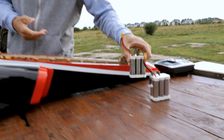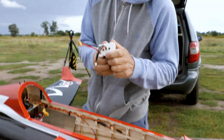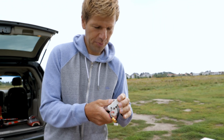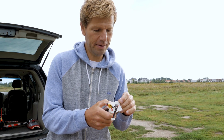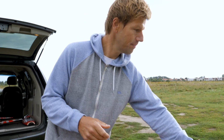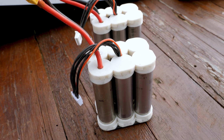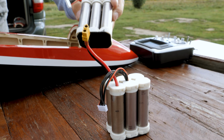And of course, for everyone that is interested, I can send the 3D printable part files. You can print it, and I recommend printing it in ASA or ABS, but ASA is stronger than ABS because it's 100 degrees resistant, and PLA is melting. If the battery gets too hot, it will melt, so I do not recommend printing it in PLA.